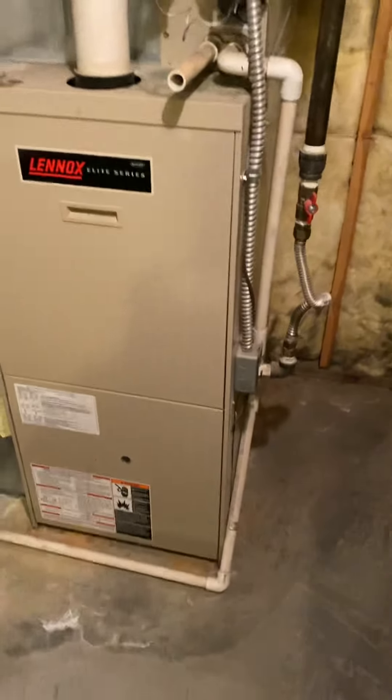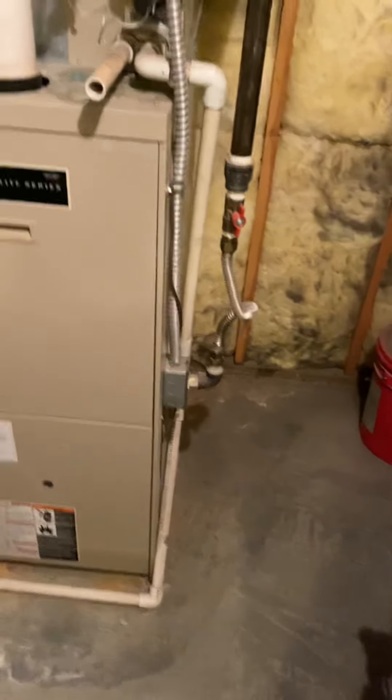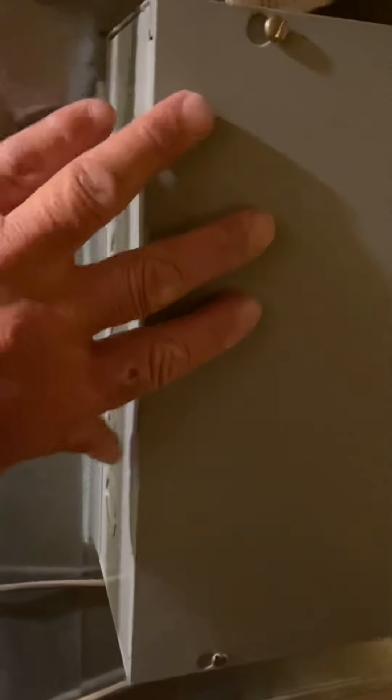The drain will be just to the floor. For thermostats, I gave you for this basement just one Honeywell single-stage stat. These zone panels are single stage, so Y1 will be basically the main floor and Y2 will be the top floor AC. On the two-stage heating, we'll just set the dip switch timer to single-stage thermostats.